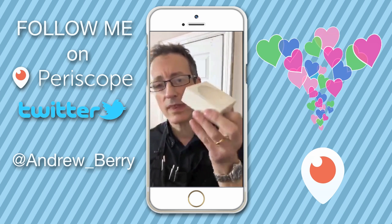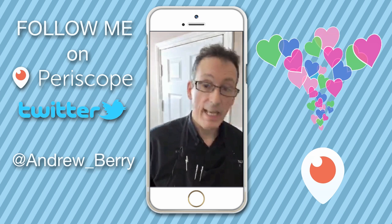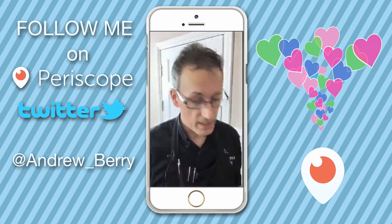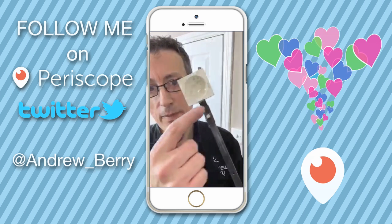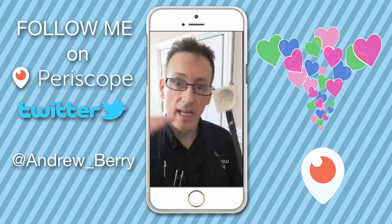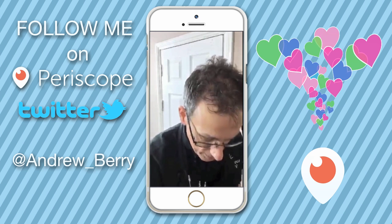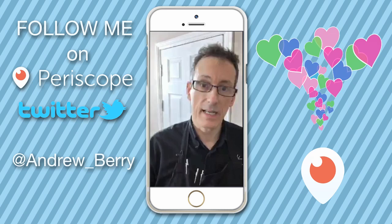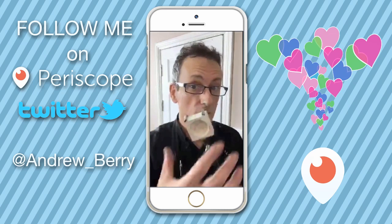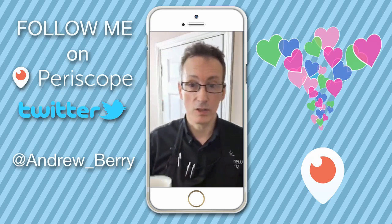Don't ever think about trying to melt gold or silver without doing this first. The borax glaze turns a nice bright red as it flows and covers the bottom of the crucible — you can just about see a little bit of shininess from the lights there. It's almost like a glaze; once the borax cools down it becomes glass-like. Once that is coated nicely all over, you can crack on and start melting your silver and your gold.